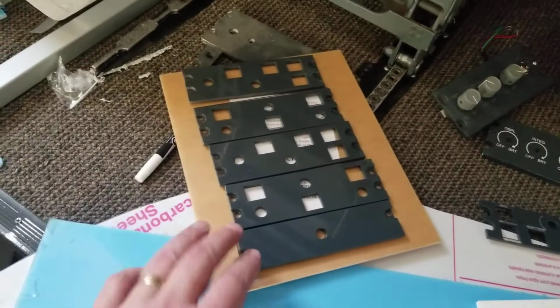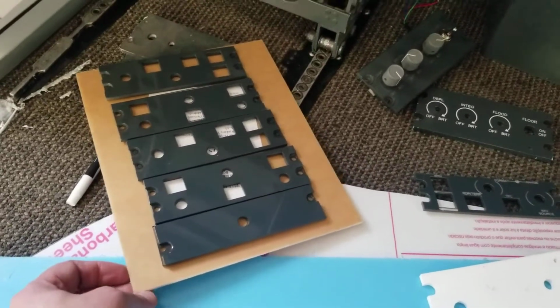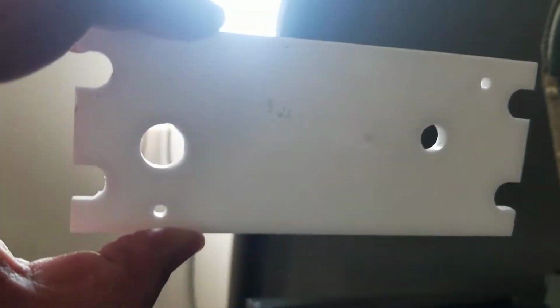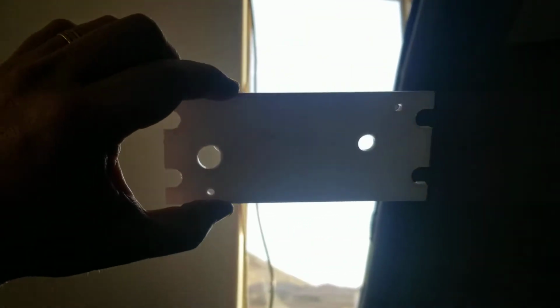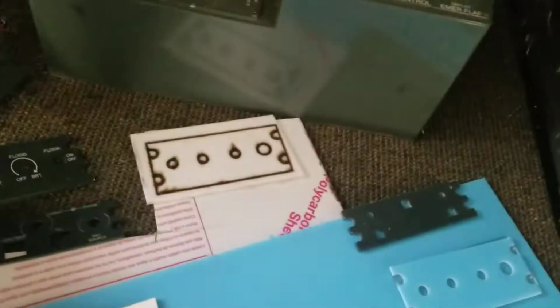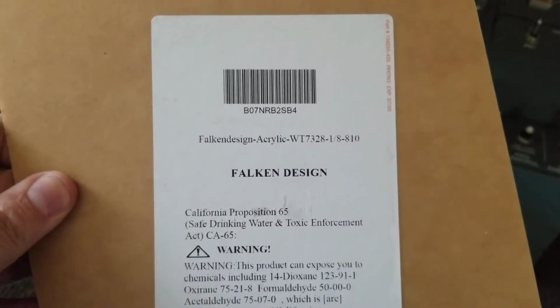But the perfect formula I found, which I'm going to show you in the next video, the finished product, is a white acrylic that has 30% translucency. It's 30% translucent, which means it's going to block the majority of the light, but it lets 30% of the light through. And as you can see here, you'd think, well, I don't know if that would really give off much light. But when you actually see it working, you go, wow, that gives off a ton of light. It works really good. So that's the material I'm going to recommend, and I'll show you the one that I picked up right there, and that might help you get started.